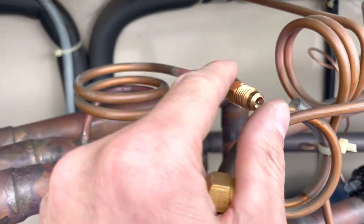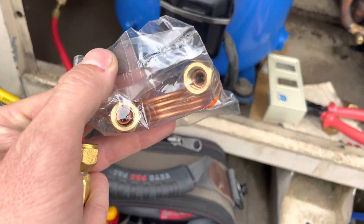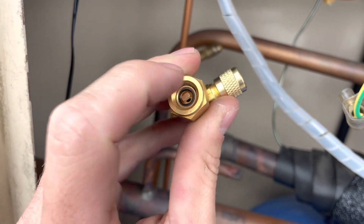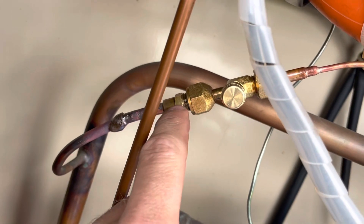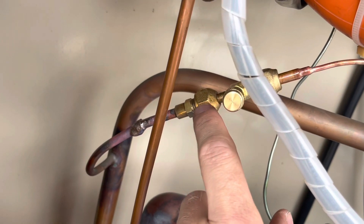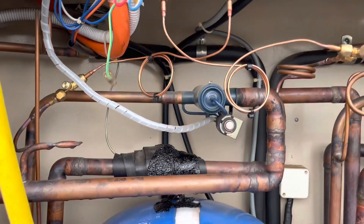Welds are done. I've shown these before, but I'm going to use the schrader fitting. Annoyingly, I thought I had the depressor capillary lines in the car, but I do not. It's a slight bit annoying, but what I'm going to do is have a schrader core fitting in there. At least you'll still be able to remove the swivel tee. I'll write that up there — there's still a way that you can remove the pressure control if we need to. I've got a schrader core in there because this has a depressor but I didn't have a capillary line with a depressor. I'll confirm that when I write it up so people know the schrader core is actually in there. Lines are going where they're supposed to — low side to low side, high to high. We'll now put some pressure in this thing and make sure we've got no leaks.